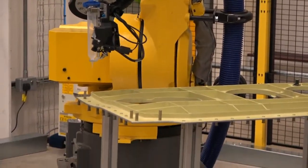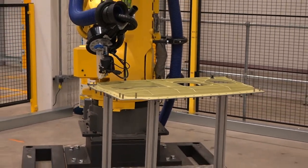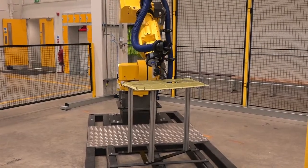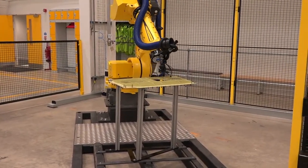That's it. And I guess you have to have a real big cable assembly to handle all the wires and cables for all the complex systems here. And that end effector looks really nice. It's a really neat little package, isn't it? Yep, it is. Yeah, that's exactly right. And feeding sealant along a very, very long tube has its complexities. So having it on the arm is very, very good.